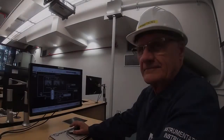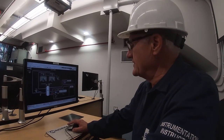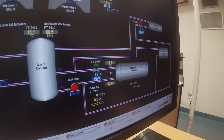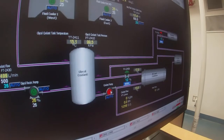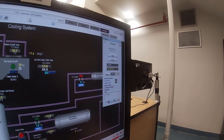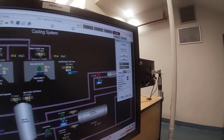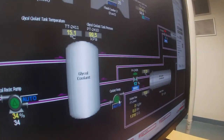Okay, we're going to get ready to start taking steam to the load condenser, which is this number one load condenser down here. It's got a valve at 12%, but there's nothing going into it, so I'm going to start up that coolant pump. So I get a startup display over here. Start. Send out starting command. It's coming back telling me that it's running now. The feedback contact indicated it's going, and you can see that it's turned green in color.